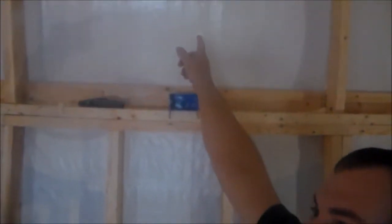You can see this white wrap — this is a Tyvek house wrap. If you all ever get any of these sheds, make sure they put this on there, because it's an insulating barrier and a moisture barrier. Same thing for the roof — it's like a bubble wrap, same kind of stuff as the Tyvek. The bad thing is, these people get a shed with a metal roof and don't have anything on it. When you live in the shed and heat it with a stove or propane, it sweats, and all that moisture will come down and cause mold. You want that moisture to go down the plastic and outside — same thing down the wall — so you don't have moisture and mold inside your house.